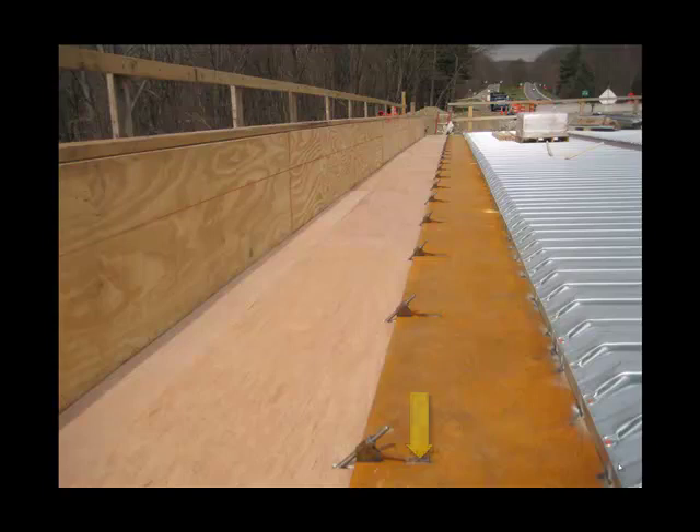In the case of this hardware, the welding is done away from the edge of the beam. You need to check on requirements for permissible welding on these beams. The tack welding may be permissible, but more substantial welding has to be done off the edge of the flange.